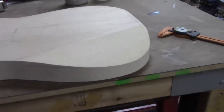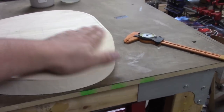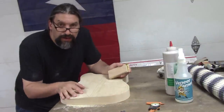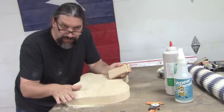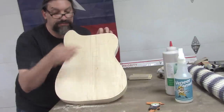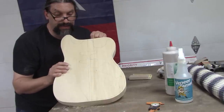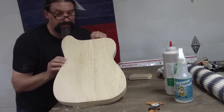There you can see the contour I started. I'm going to smooth this out with a little bit of hand sanding — it feels pretty good right now but I want to get rid of a little bit of this crisp line, and sometimes it's easier to do that by hand. Alright, I think that looks pretty good — the transition is nice and smooth. I cut this body out already mostly so the contour would be easier to apply. I left about a quarter of an inch of material all the way around, which will be good because when we go ahead and put this in the vacuum bag, I want a little bit left over so I can trim it out.